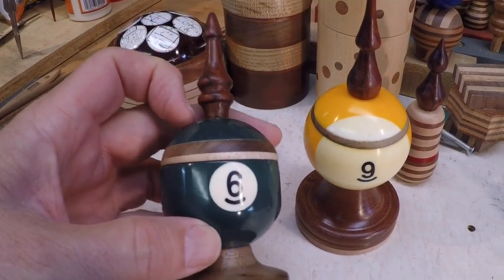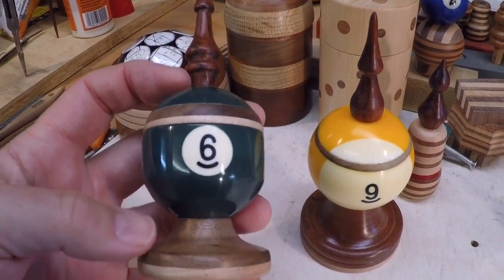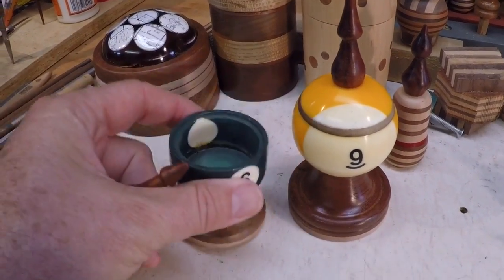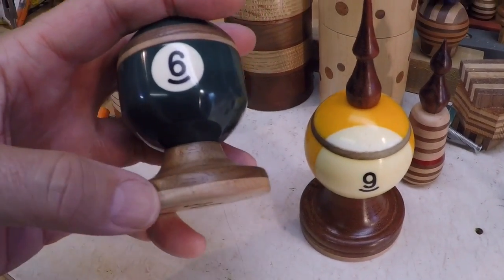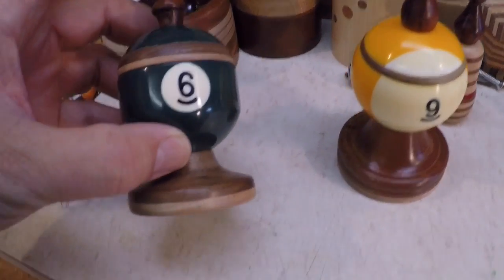The basic design is that you just cut the ball in half. This one I machined into a cylindrical shape, and the top is drilled and the bottom is drilled. There's a piece of 10-24 all thread in there that I used to attach the wooden base and also the finial.